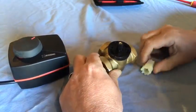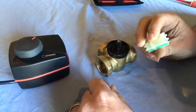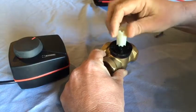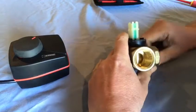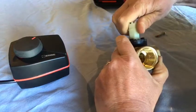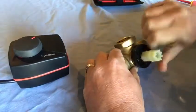This linkage is basically a nut and one of the nuts has a groove that runs the whole length of it, which I've highlighted in green, and this linkage can only fit onto the valve body one way. As you can see I'm struggling there - if I turn it over and eventually it sits in. There's the green marker and what it replicates is where the shoe of the valve is. If I turn that 90 degrees you can see the shoe opening up and we can see right through the valve. The groove tells us what position the shoe is in.